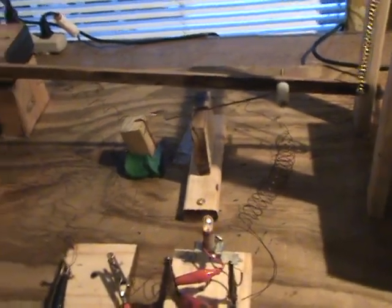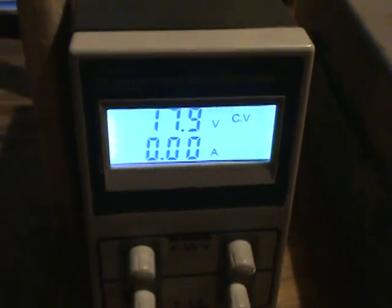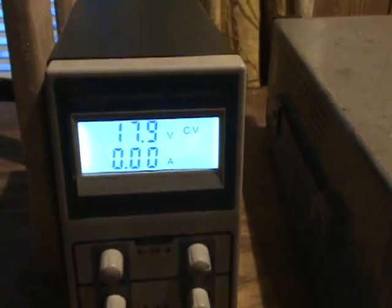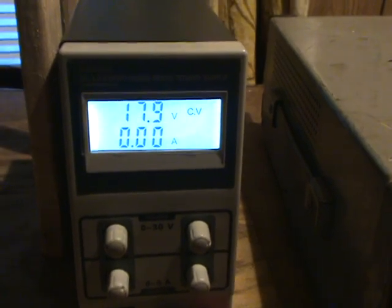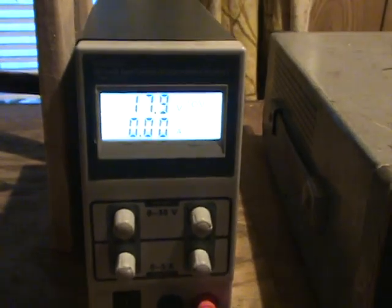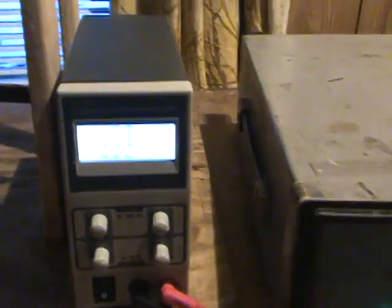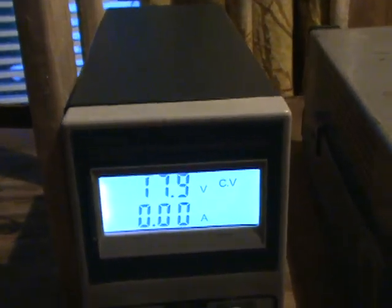Thanks to some of the comments I had on number one, one of the flaws identified was the power supply itself. You can see it has around 17 volts — I have 17.9, 18 volts — but it's not showing any current being drawn. That's where the fallacy is: the current was not being really read by the power supply. As you can see on the scope, we have power spikes. Spikes are one of the hardest things to really work with, and because it's such a fast spike, the amperage part of the power supply is not recording that.